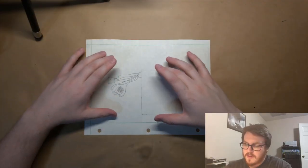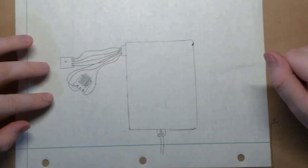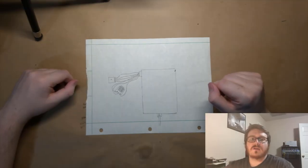Now, the physical setup is fairly simple. I'm going to have a watertight enclosure that's going to house the Raspberry Pi, and I'll have those two sensor modules on the outside of the enclosure to report the data back to the Raspberry Pi. Now, direct sunlight is no good for temperature sensors, so how do you get an accurate temperature reading?